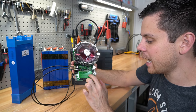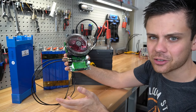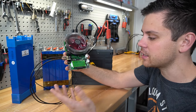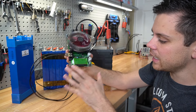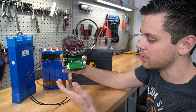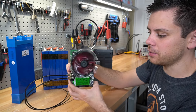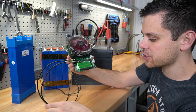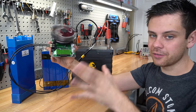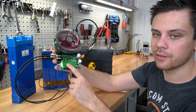For most solar batteries your capacity will be large since this is stationary energy storage. At a 0.2C rate with only 14 amps, a full capacity test will take six or seven hours. What's nice compared to other methods I used to use is that you can set it and leave it — I go to bed and come back in the morning with battery capacity test results. As long as this is plugged into a wall, you have a solid connection, and you have a fuse or OCPD on the battery, you are fine. It will disconnect at the BMS and the test will stop with your results.